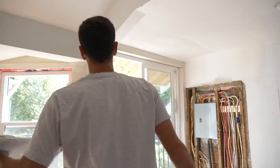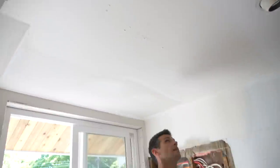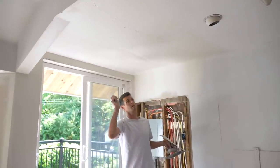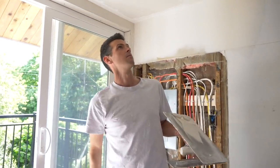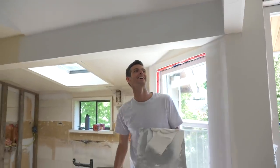Look at those bubbles - those horrible, vicious, cruel, disgusting, heathen bubbles. So after I sand this on my final coat, what I'm going to do is pass over all those with some quick set and my six inch knife, and then they won't shrink back. But yeah, don't even bother - that's so bad. Those are so bad.